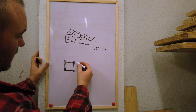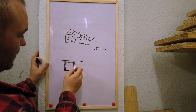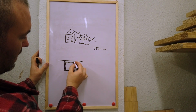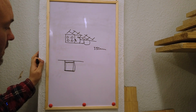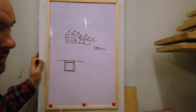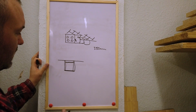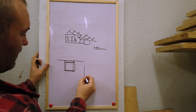And what that means is the wall would be there, so you butt it up against the wall, and you've got this void there which allows you to cut around for any pipe work that goes behind the unit. So I don't bother with that because it just makes the fitter's life harder. Obviously these are designed, you know, not by the people fitting it. So what I do is I actually make the unit shorter, so I don't bother with that. So I make my units flush.